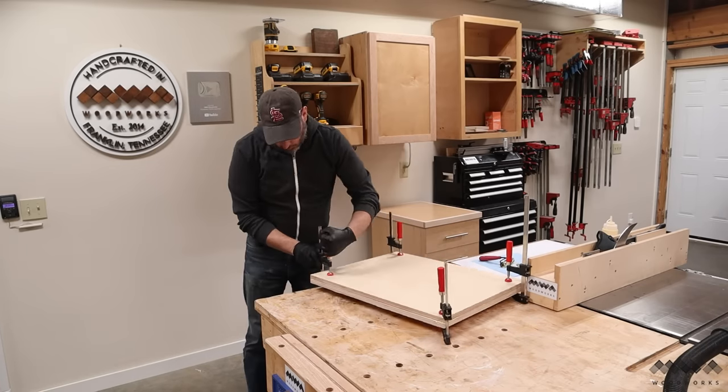For the fence on this table, I went with an aluminum extrusion from a company called Misumi. They've got lots of different aluminum profiles, but this one seemed perfect for my application and is considerably cheaper than buying an aluminum fence from a woodworking supplier — this 600 millimeter piece cost me about $12. It's got tracks in it so you can attach stop blocks, and I can use it upright for more support or lay it on its side as a really low-profile fence so the handles of the drill press don't bump into it. To make the fence work, I drill holes for the T-bolts on the wide face as well so I can use this fence in both directions. Then I can add the fence and this thing is ready to rock. You can also see how those magnets in the back do a great job of holding stray bits and keeping them from rolling off the table, and I can use the bottom tracks to store my stop locks and hold-downs.